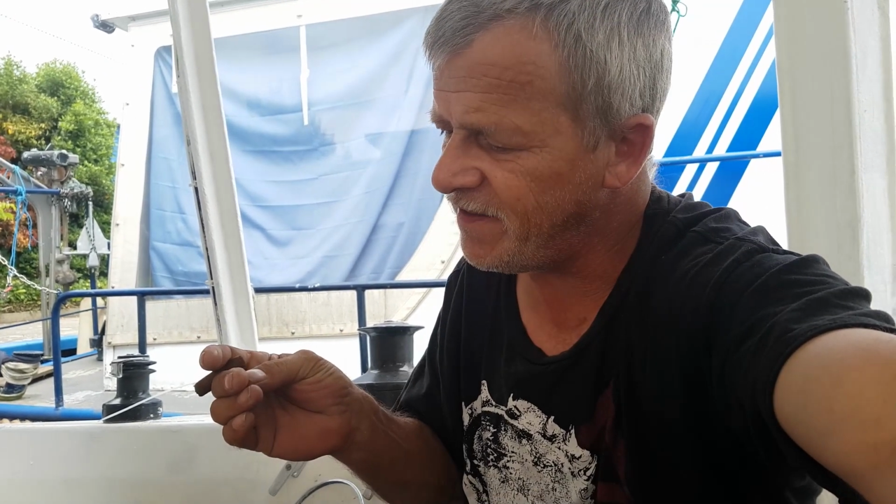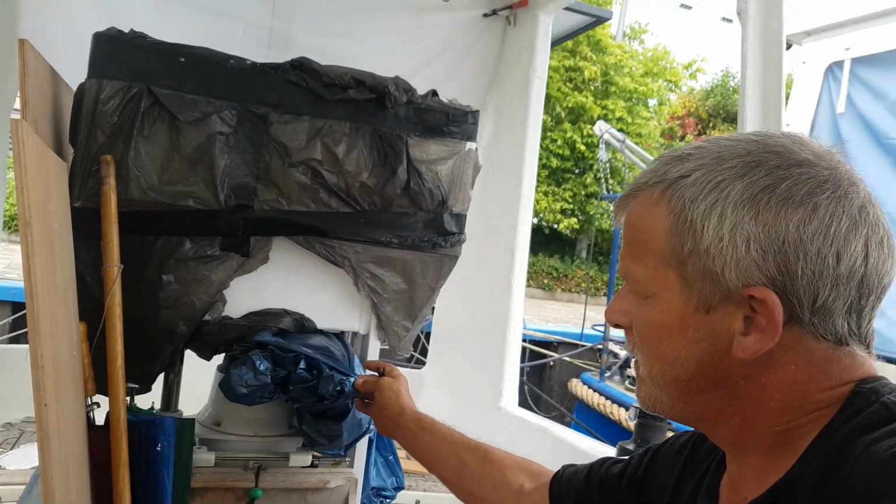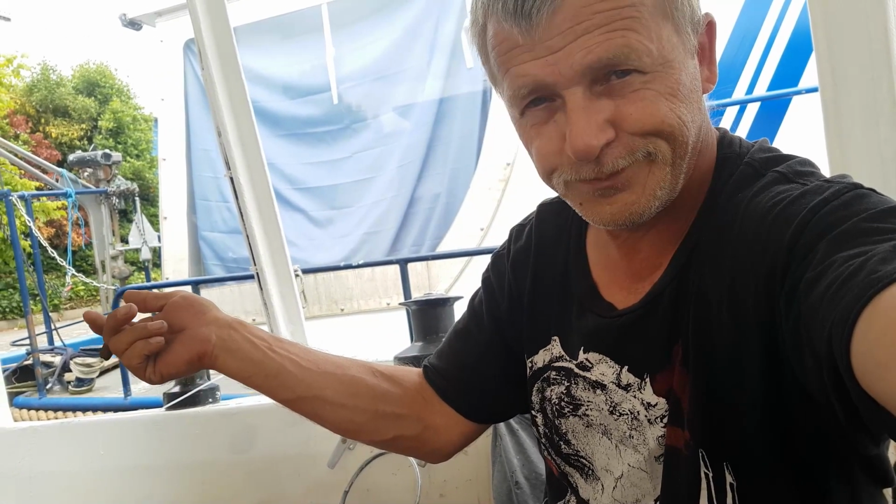And be careful, it has sharp points. It is glass fiber. You get it in your finger, you don't see them, but you feel them. So be careful. You see me in a short t-shirt? Don't do it. Take a coverall, the special one, so you can also use it for painting, but these are the thick ones. You see this one, those are the good ones. So the fiber doesn't go into your pores, and shower after it. Every time when you are finished, take a hot shower, so all your pores open and you can get the small glass fibers out. That's very important.